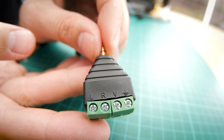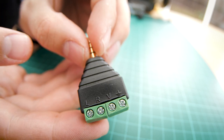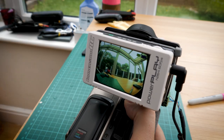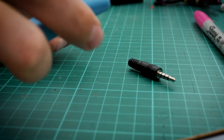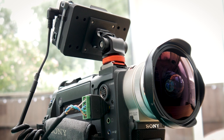For 3.5mm AV outs, I picked up a couple of these handy TRRS to screw terminal adapters. I rearranged the wires on the cable included with the power play and hey presto — here's what you need to do. First, snip off one of the jacks. Keep in mind when we're done this cable will be directional, so you have to think about which one you're going to keep. I kept the right-angled one.